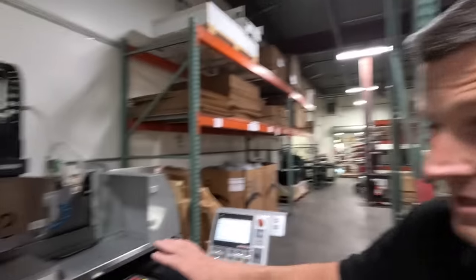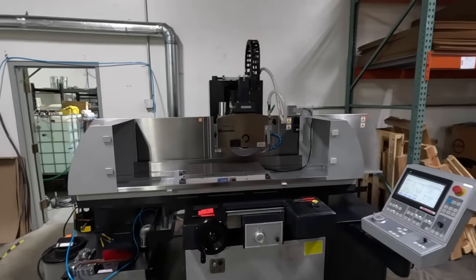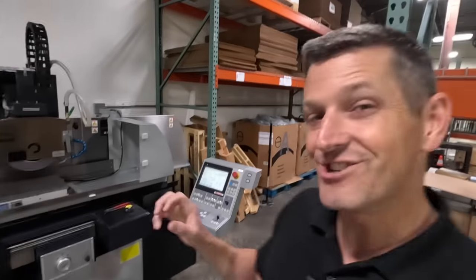Do your own research for your application. What I found true across most manufacturers is that semi-automatic doesn't have a screen. It does have what I call power feed — you're not going to be turning cranks to grind or move your X. It has that power feed, but it has no other level of intelligence; you kind of just control it with some buttons, maybe some manual down feed click options.